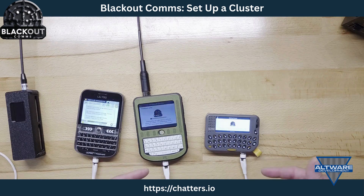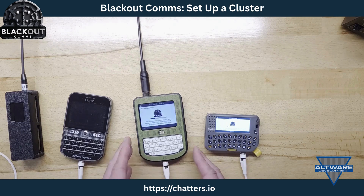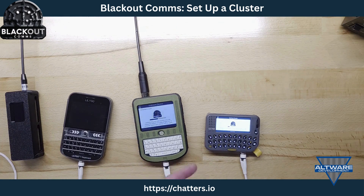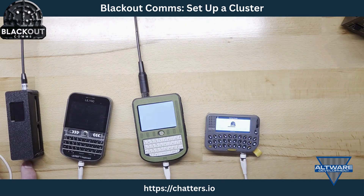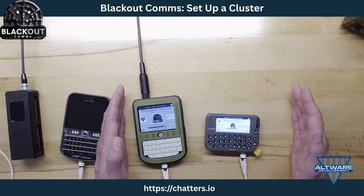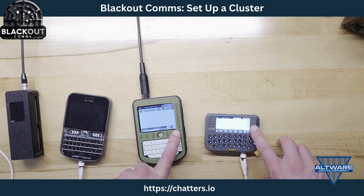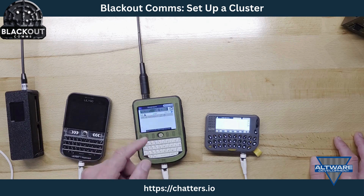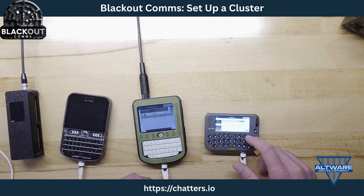The pairing should take a minute or two. Once in a while it will get stuck and you may need to restart the devices and try onboarding again — that doesn't hurt anything. What's happening is the root is sending all of its settings and cluster information to the joining device. Leave them alone and let them go. They restart, and now instead of a cluster of one, there's a cluster of two — the antenna signal goes green because they see each other. In the neighbors list, Rockland sees the pager and the pager sees Rockland.